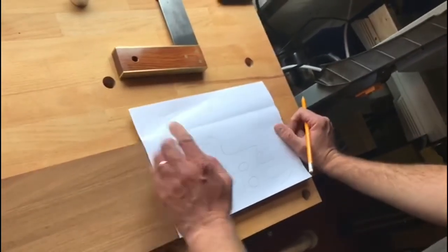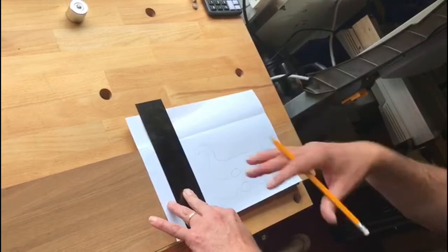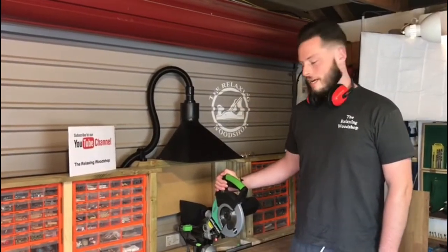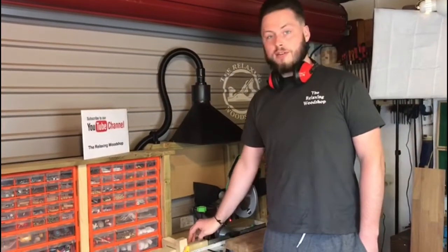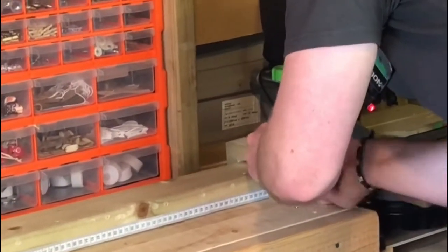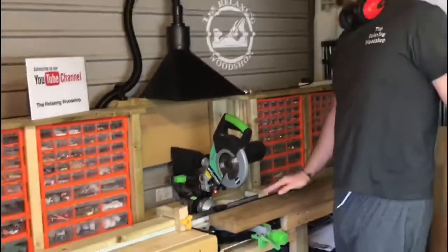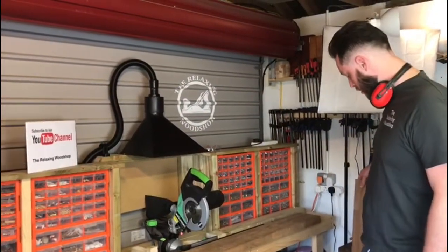So let's get this over to Christopher. I'm going to measure this off just here at the end so Christopher knows what to cut. It might not look much what we're doing at the moment, but once you see Christopher in the miter station there might be a bit more chance of understanding. Here we are over to the miter station. Thanks dad for doing the artsy bit there and getting the measurements for me. We're going to set up the jig at 23.5cm, just to give us a little bit of wiggle room so we can creep up on the true measurements. We're going to cut two of the thicker bits off the walnut and then another two of the thinner bits for the outsides of the rocking chair. This is going to be noisy so let the music play.